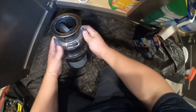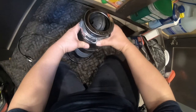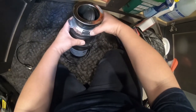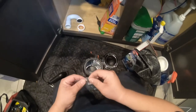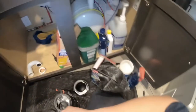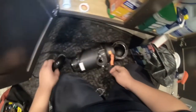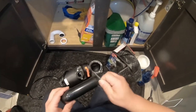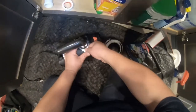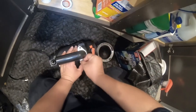This is how you remove it to get everything out. As you can see, it has about three male-to-female connections all the way around the metal ring — that's how we'll install it. This is the metal clamp that holds the drain pipe in place. The metal pipe should include a gasket and it's already in place, so you don't have to add one. Make sure that rubber gasket is seated at the bottom of that metal clamp, otherwise it will leak.